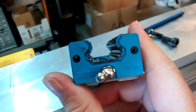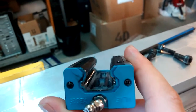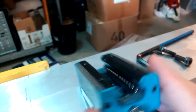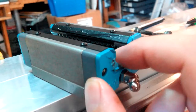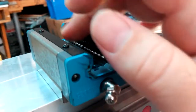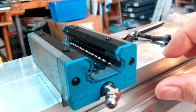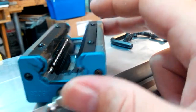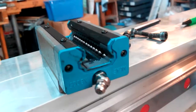Inside the bearing you'll see four rows — one, two, three, four — and those are like little tank tracks. There are lots of individual bearings but they loop around, so as they roll you get a new set of bearings recirculating. If there's too much grease pumped in, these little bearings have a hard time going around. Each bearing will roll on the rail, but because you can't get a new set of bearings recirculating, you jam them up and they very quickly grind away at the bearings and the rail. So we just want a thin coating of grease. They come pre-greased and we do not want too much grease — it's a very bad thing.